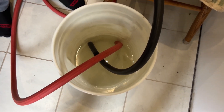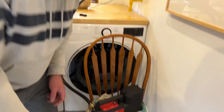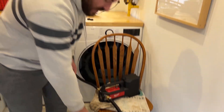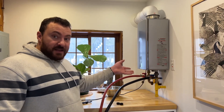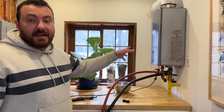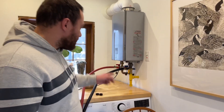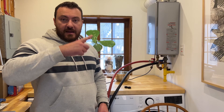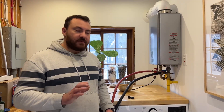It's been about 15 minutes now and things are not going according to plan. The vinegar hasn't really darkened at all. The pump was running for over 10 minutes and the flow rate from the return hose was just a trickle — normally the vinegar is gushing out. Either the pump's not working properly or the inside of the heater is really clogged. I'm going to leave the vinegar sitting inside the heater to continue dissolving any lime scale while I disconnect the pump and test it separately.